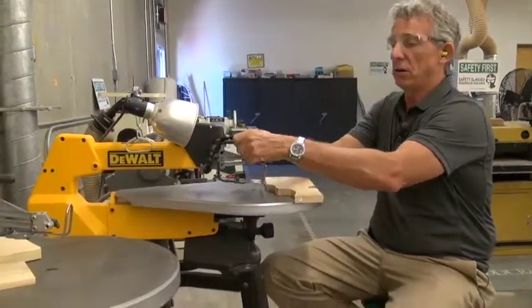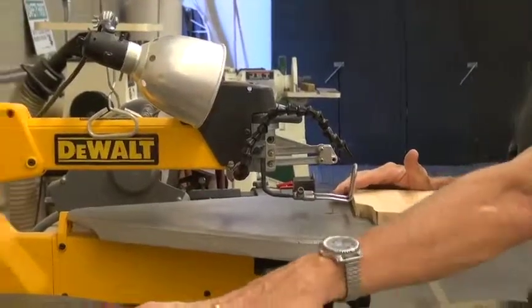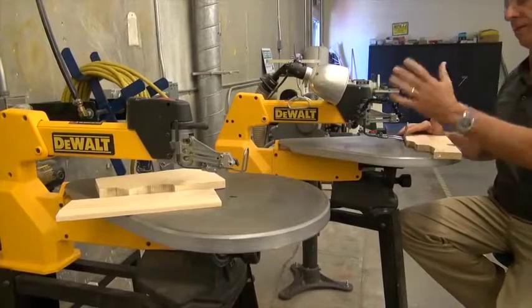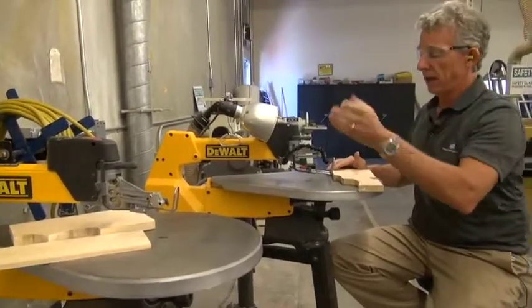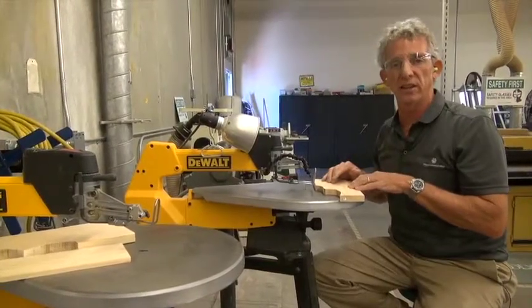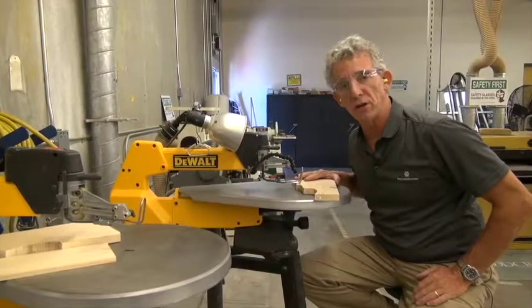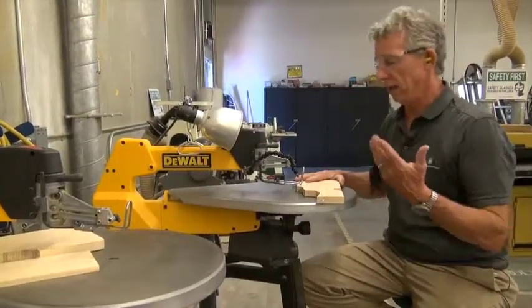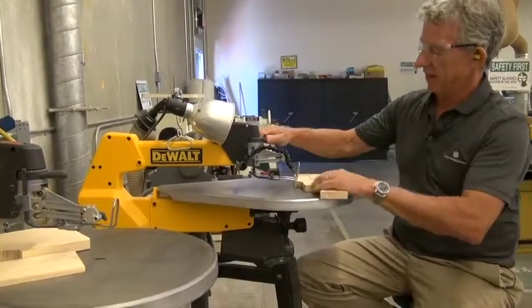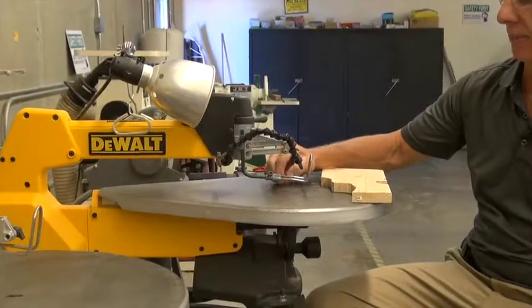This right here, all right, and we have two scroll saws. You have one here, and you have one over here, and you notice this piece is gone. All right, some of them have them, some of them don't. Some people knock them off. And all this is doing is blowing the sawdust off so you can see the line. If this isn't here and you're using the other one, you have to do it the old-fashioned way and do it yourself. All right, right here, this will tighten and loosen the blade.